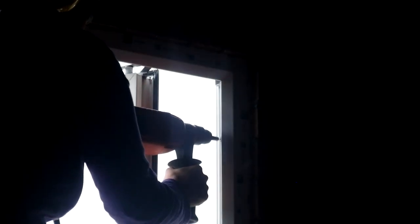I'd packed it just a bit too high, just a touch. Another tip I learned was to drill your holes closer to the packers, because if you're quite far away the frame could actually warp, making it difficult to close.